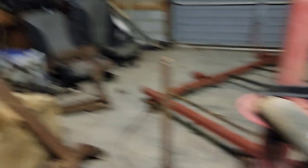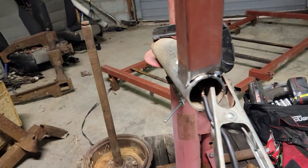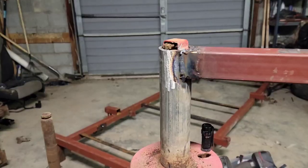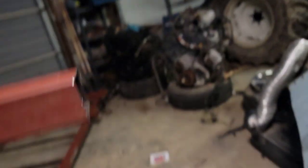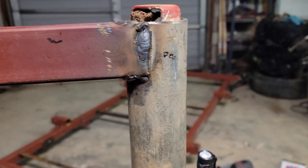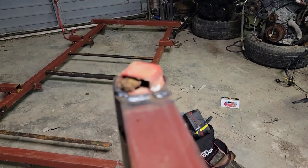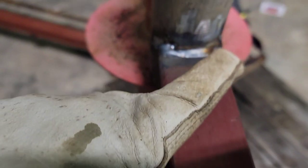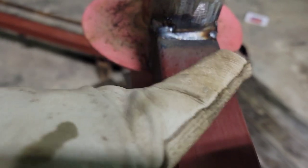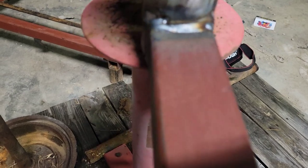The way I did it probably would have worked if I'd used that big tubing. But I didn't want to use that piece because I wanted it to slide back and forth. So I've got to make sure it's squared up and then I'll weld it up. My gap was way too wide at the bottom, but I filled it in. Got the pole on here. Here's my welds — blowed through right here, so I had it just a little bit hot. Here's the back side. I had a really big gap here, so I laid a bead on my pipe and got a good hot bead. Then I kept running a bead over a bead, brought it down, and brought my tubing into it and welded it. I think it'll hold.